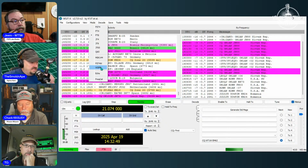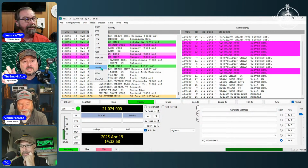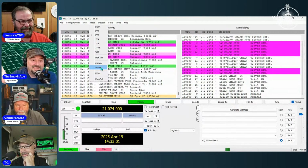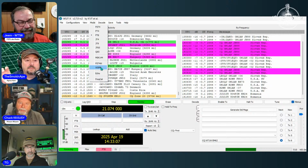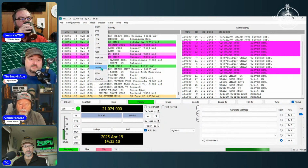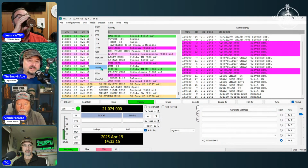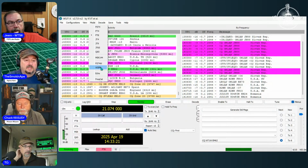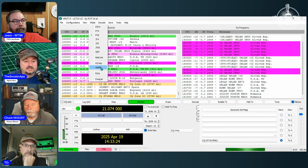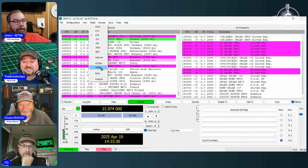Where it gets tough is, and I'm not hating, but radios like the G90, when you turn that rotary encoder, I think each click is a watt. So where it became a bit of a challenge for me is that when I was messing around with that Neptune amplifier, I could only go in increments of 1. And sometimes you need 1.5 watts, not 2 watts, because it'll drive the amplifier differently. 1 watt's not enough, and 2 watts is too much, right? And 2 watts is 2 watts too many.